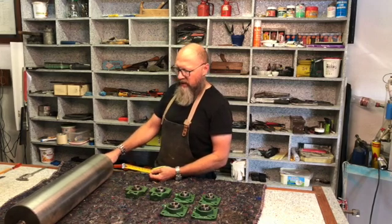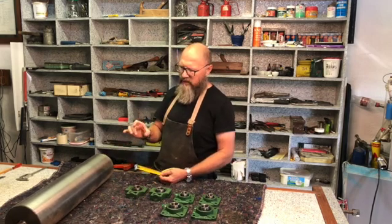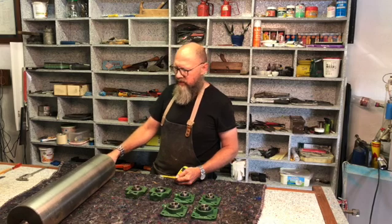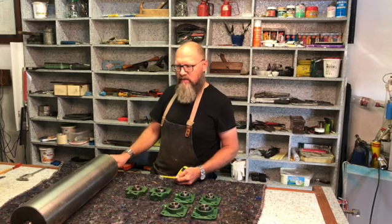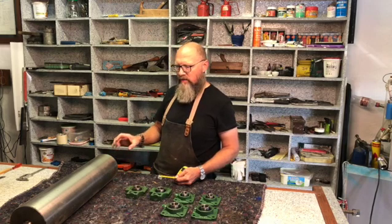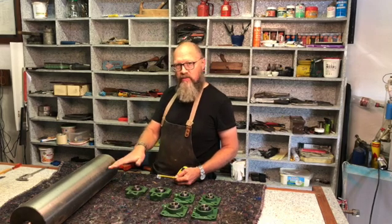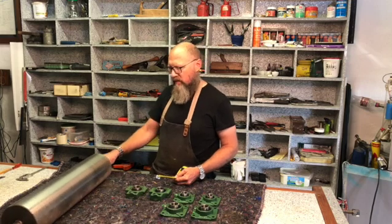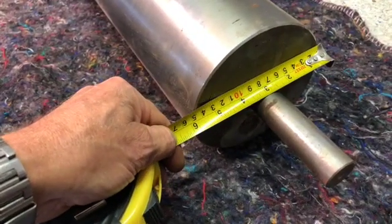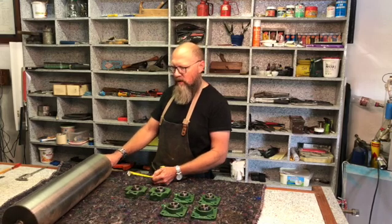You work from there — a nice size. The rollers mustn't be too small because then your area of pressure is very concentrated. The advantage of a bigger roller is it doesn't slip easily. If your rollers are too small, you might turn the wheel and your work won't go through. So I've decided to go with a 150 millimeter diameter pipe, which is more or less six inches.